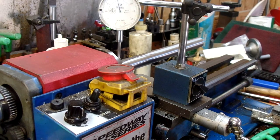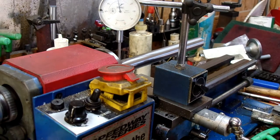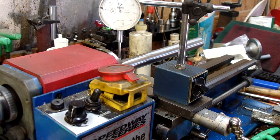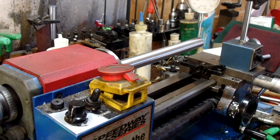There's been a discussion on lining up these Chinese mini lathes. I went through a lot with this thing to try to get some accuracy and it's still not perfect. I have an issue in the spindle — you may be able to see the needle move just a thousandth or so, much better than it was, believe me. This is one setup checking the vertical axis, and as you can see I'm pretty well straight vertically.